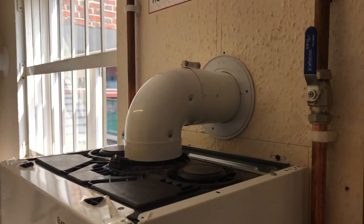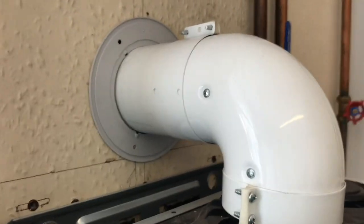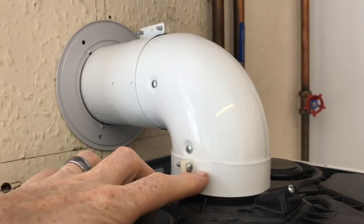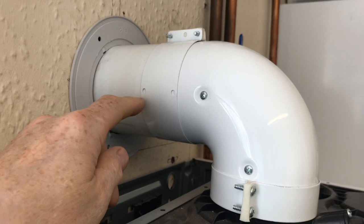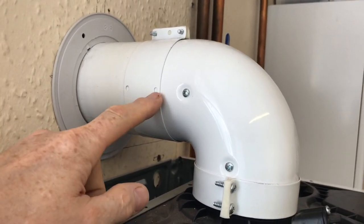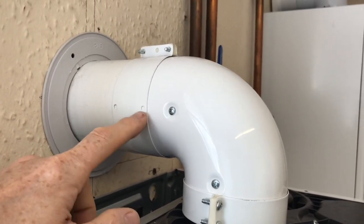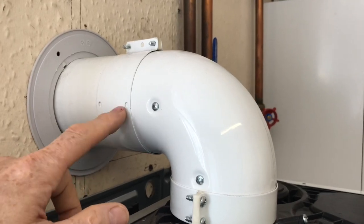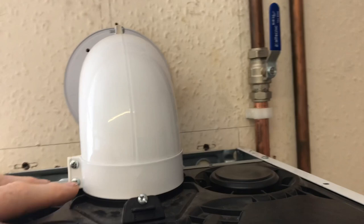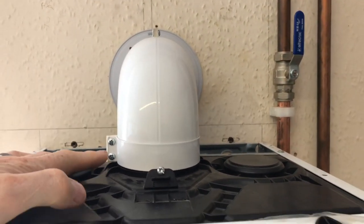This is the top of the Ariston boiler and you can see the turret here with the sealing ring. This is a lot like the Vaillant boiler, but the manufacturer's instructions don't say anything about screwing in two screws here like it does on the Vaillant - no mention of it, no screws sent. This is our bottom seal - the smaller one goes at the bottom, the larger one on the flue elbow.